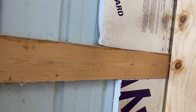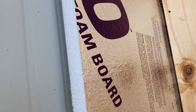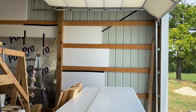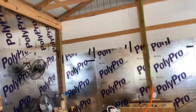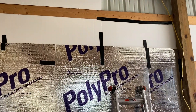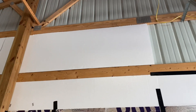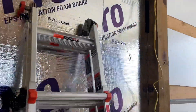What I ended up deciding to do is use an inch and a half foam board in between the studs. This is the first section I did, and I did it backward from how the rest is done. The foil radiates heat out, so I've got the foil facing out on the first layer that fits in between the studs, and the foil pointed in on the second layer — so whether it's winter or summer we should be radiating heat appropriately. On the first layer I've cut it tight so the pieces are forced in, eliminating the majority of air gaps, and then slid them behind these beams.